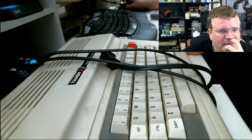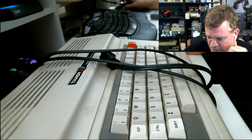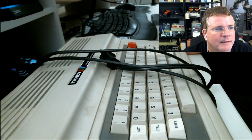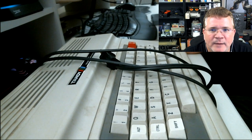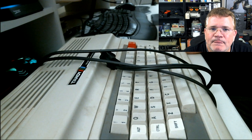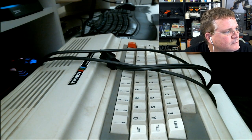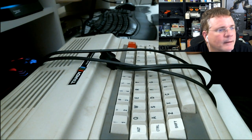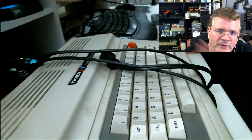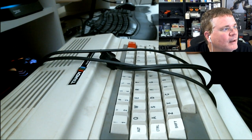And on that one, because the RAM is soldered onto the PCB, there's nothing to reseat at that point. It's really just you reseat the board. Correct. And I saw in the latest Glenside newsletter that Jim Breen is working on a 2 meg memory upgrade that plugs into the Gimme socket. I guess the RAM kind of piggybacks off of that. It would have to go in the Gimme socket because the header sockets that the 512K plugs into don't have enough address lines to support 2 megs.